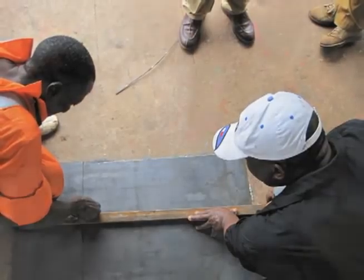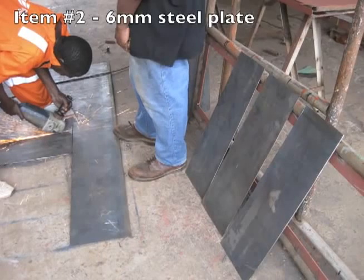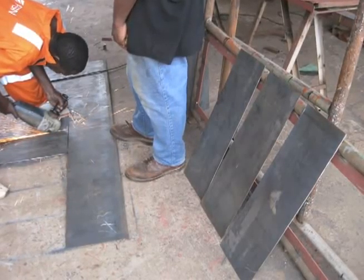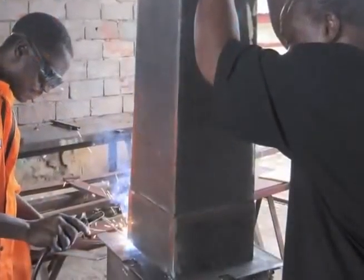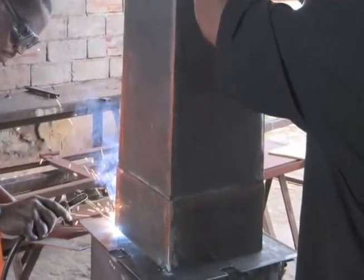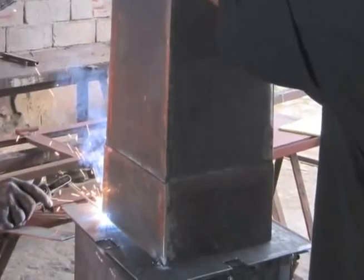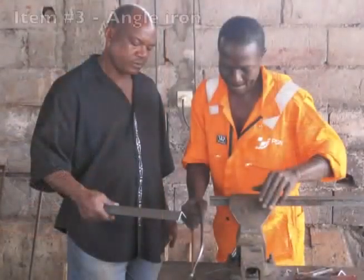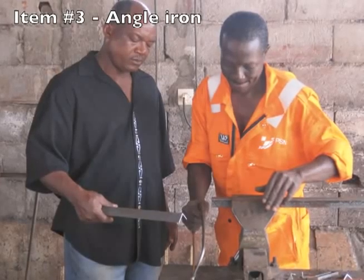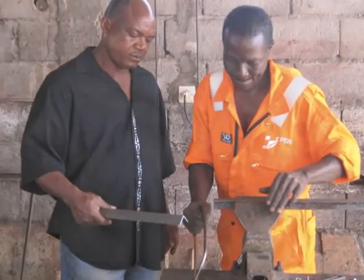Here's a tip: make sure you don't use steel that is thinner than 3mm as it will bend too easily. If you can't find a sheet that is 3mm thick, then use 4mm. You will also need 2 sheets of steel plate, 6mm thick. 6mm steel is best for creating the diffuser ledge and a strong base, especially if you are using a diffuser plate and not a diffuser basin. If 6mm steel is unavailable, use 5mm.